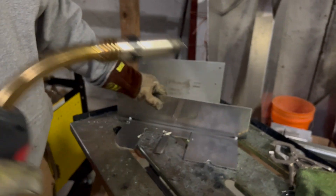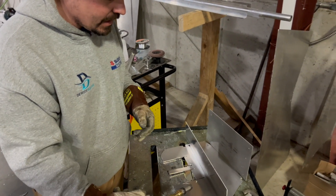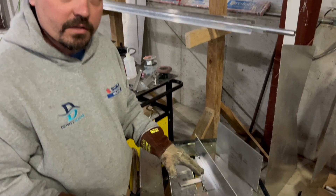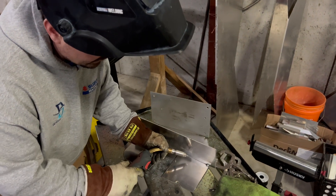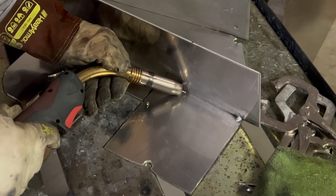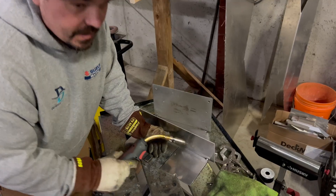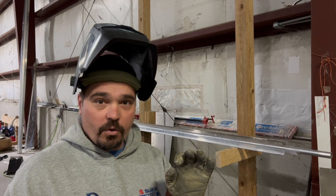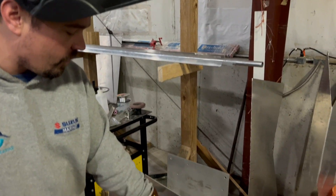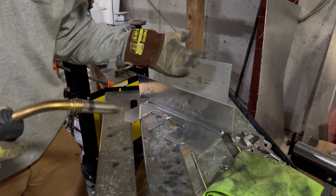What I've found with this welder is that it really likes a pretty steep angle in terms of a lead-in. I'm going to give it that steep angle to lead in, build my puddle as it gets going, and then pass forward, come back into it — pass, come back, pass, come back. The cool thing about this welder is I can actually watch my puddle turn into that little dime, that little circle, and then move forward and build another circle on top. I'm going to do just about a four or five inch weld here. Keep in mind I didn't preheat this other than my tack weld from a couple minutes ago.